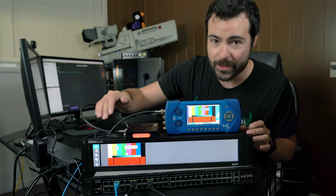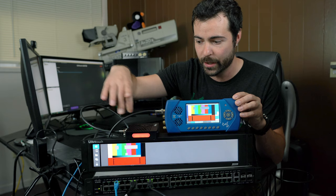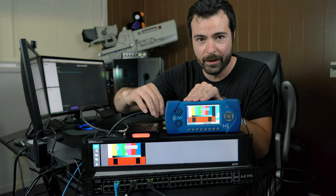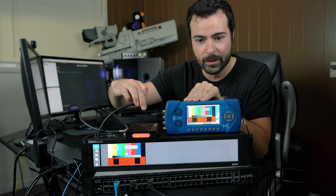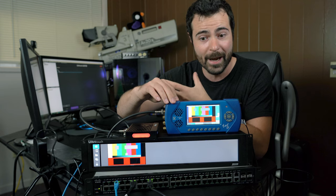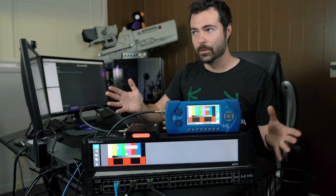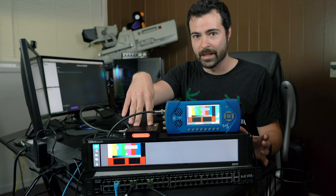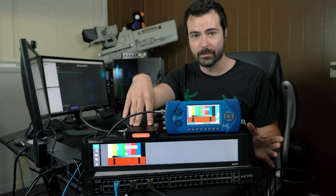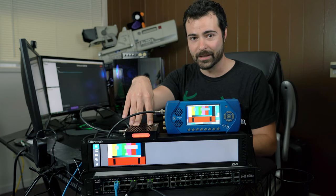And there we go — it looks like it's working. The video is being sent out, encoded into NDI, and we are receiving it on our NDI plug-in on our custom Dashboard panel. In theory, if I pull the cable out, we lose that connection — and if I put it back in, we get it back. Perfect. This is going to work. The next step is to attach the BirdDogs to the PIX outputs of the CCUs and build a custom panel to house those video inputs.